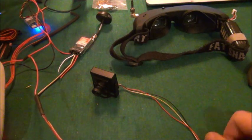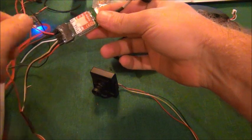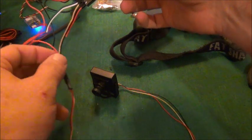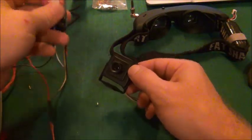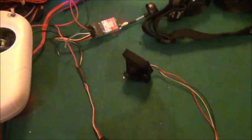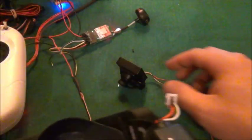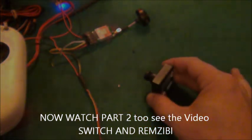I wanted to show you how it's wired up. I have my power coming into the video transmitter, my video and ground going into the video transmitter. I jumped the power to also go to the camera because it's a 12-volt camera. It's plugged into the Phantom using that external plug for power. Ignore the blue light — that's for the GPS on-screen display, which I'll show you next. With just the transmitter and camera hooked up, I have video through my goggles — it might be hard to see but the video is crystal clear and it's working.